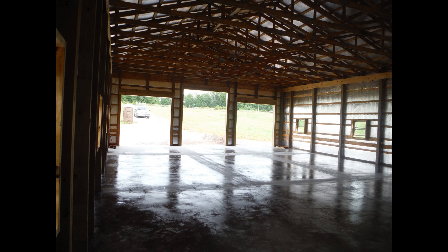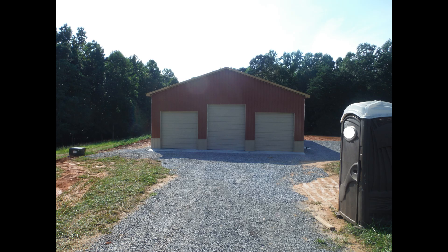Because there's always a chance that you'll have material shifting, expansion, or shrinking with weather, relief cuts are made to control where any possible cracks occur. When the floor was cured, the garage doors were added and the electrician came in and installed the electrical panel on the inside of the building and the one outlet required so I could have the final inspection.